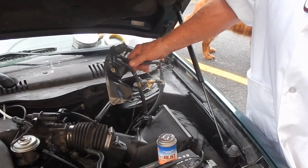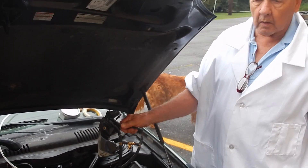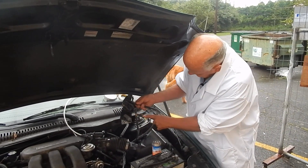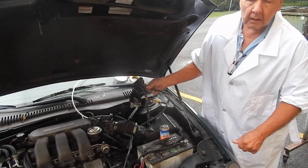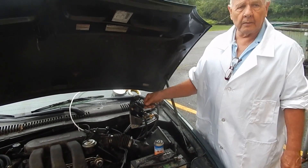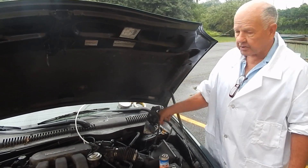The first thing I did was put a couple of extended tubes on this thing, because I was not going to go back under there and put it in and out every time — it was such a pain in the neck. So I made up a T, put it across the lines, and put a needle valve on. I've got the needle valve open just roughly exactly one turn. And all of a sudden things started behaving themselves. I'll be damned — I apparently outwitted the machine.